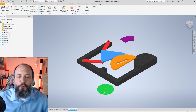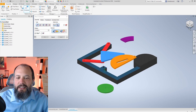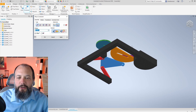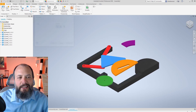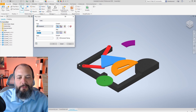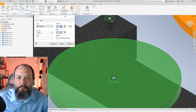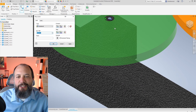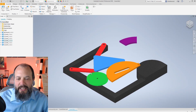There's one more pin joint for this green wheel, which attaches right here on ground. I create a mate constraint where the top surface of ground is against the bottom surface of the wheel, hit Apply and Cancel. Then I create a rotational joint, zoom in and click on the center of the hole, then the center of the top of the pin. The wheel moves into place and it's spinning. Hit Apply, Cancel, and zoom back out — it's now in place.